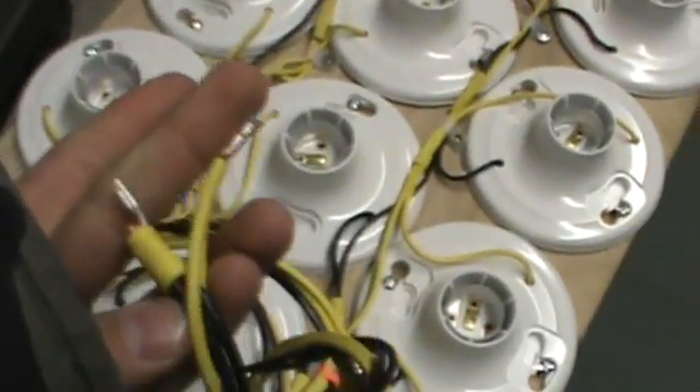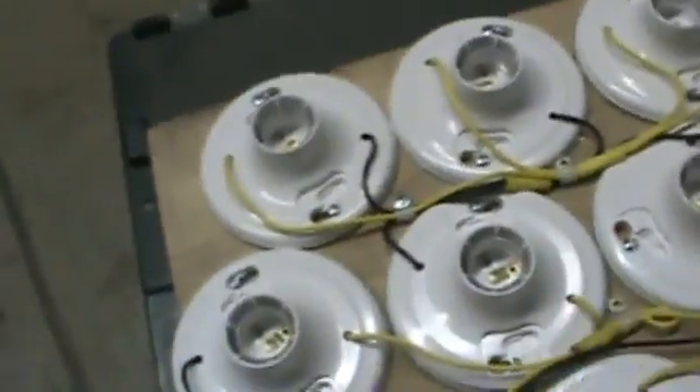Right here are the inputs for them. What you can do is wire these in series with the MOT and have a ballast. How these work is each one of these sockets has a light bulb in it. Say these are all 100-watt light bulbs.